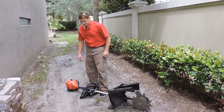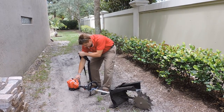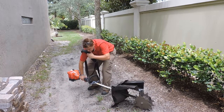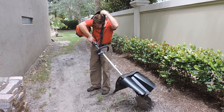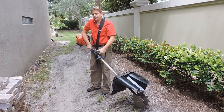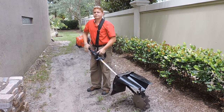First, you'll need to ensure that you have a proper handling of the trencher. With your left hand, grab the strap and slide your right arm through it. With your right hand in the strap, grab the throttle handle and lift up the trencher. Now, using your left hand, pull the strap over your head so that it rests on your left shoulder. And finally, adjust the strap so that the throttle is near to your waistline.